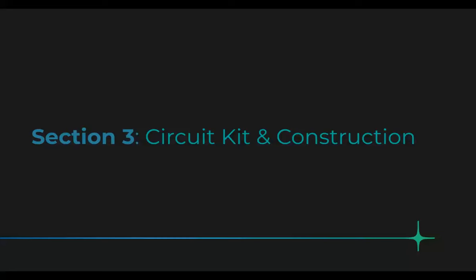So, if you look at your multimeter carefully, you'll see that there's three slots. Most multimeters have three inputs. You have a 10 amp max on the left side. You have the ohm, the V, mA, and a signal sign in the middle. And then you have COM on the rightmost side, okay? COM is your ground. So your black cable goes into COM, right?